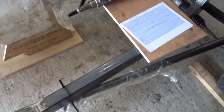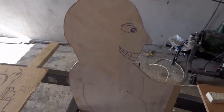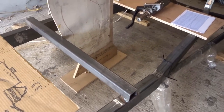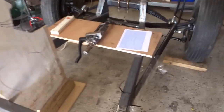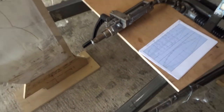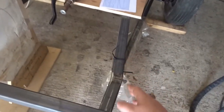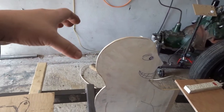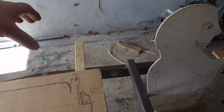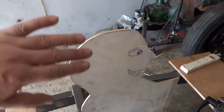Because the chassis is the correct height above the ground as it will be on its 31-inch rear tyres, I can now work out how high my head will be above the chassis rails. From the cross-sectional diagrams I've got — which I'm going to cut out in plywood as cross-sectional rings — at each of these marker points I can work out what the roll cage needs to look like, how it's going to be welded, how tall it's got to be, and from that how big a fairing I need on top of the belly tank.